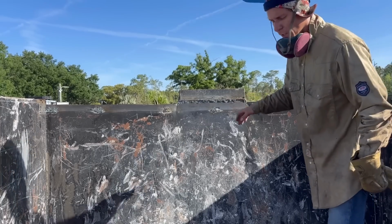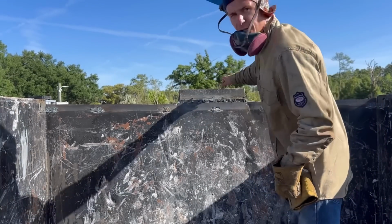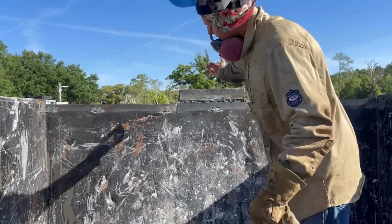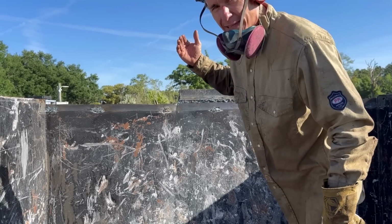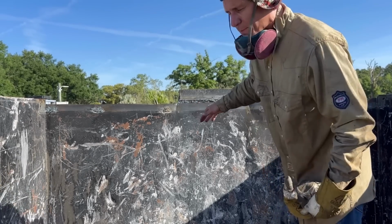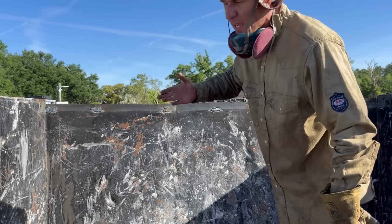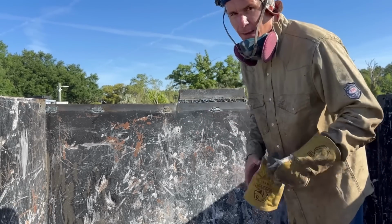Came apart pretty good. Did you see what I did there? I just nipped everything away. And now what we're gonna do is I'm gonna get them to get the excavator over here and push the whole front of this can back into place. And the reason I'm not gonna put the bar in first is because I know there's gonna be plastic deformation. I need to push this past the point of being straight in order to get it straight. So let's get them to push it now.